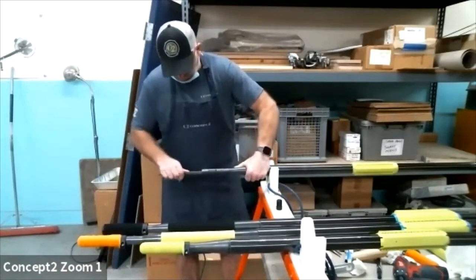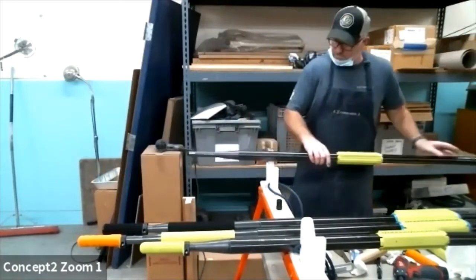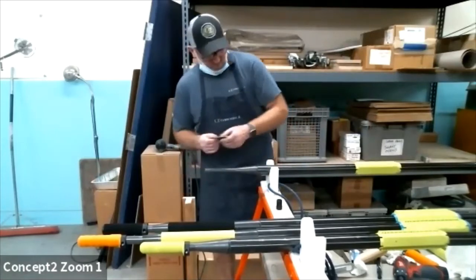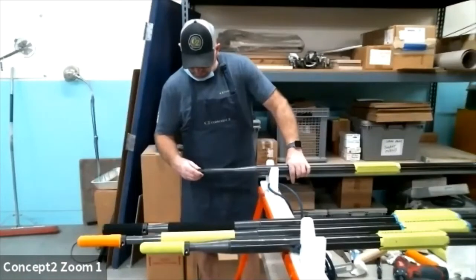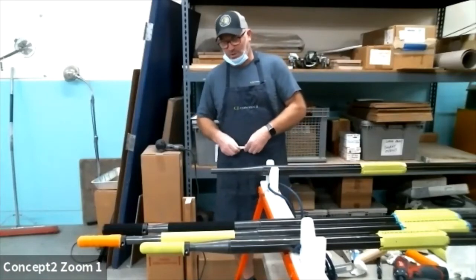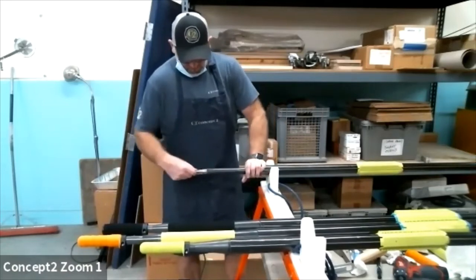That's pretty typical for all of our repairs — any one you do where you use a piece for, you want to make sure you remove all the pieces. My finger in there feels pretty good. Tap it out. We had debris and some chunks of Loctite that just came out. Also sand the end of it a little bit in case there's anything on the outside. The one thing I always do is check and make sure it will slide in without glue — do the dry fit. It's pretty close, but it looks like I need to sand a little bit more. Do that first because if you get glue on it and you can't get the plug in, you'll end up with a plug part way in and you'll have to remove it and start again.